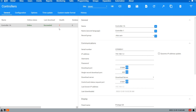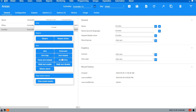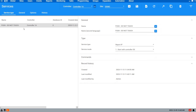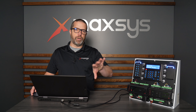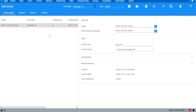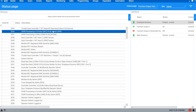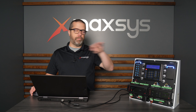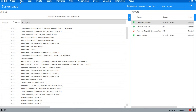Now my two areas are completely disarmed. I can close this — the health issues are back to two. I cleared the restart event and the keypad is back online. Now I go to Areas and arm the 24-hour zone on the areas so that health issue disappears. If you had reporting services, the health status page would show an event saying you need to start the service, but in this case it's already running. Also check the events page for anything abnormal. I always suggest taking a master card with access to all doors and running around the site to make sure readers are working and door schedules are in place for automatic unlock schedules.